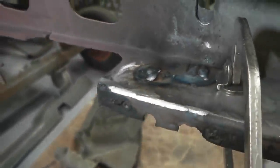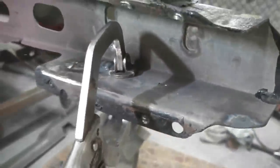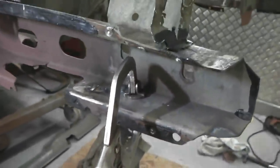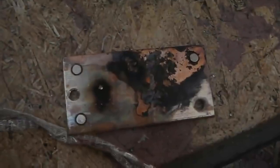So there's a couple more pinholes that I would have spotted, but we've flatted that down, it starts to disappear. Would you believe that's the same piece of metal? How good was that? There's one more pinhole left, but that's a pretty good idea. If you don't want to start making sections, or you can't actually do it for whatever reason, there's the copper bar. In fact, this one did have the magnets on it, although I don't use the magnet. I found them not powerful enough, so I just used a clamp.